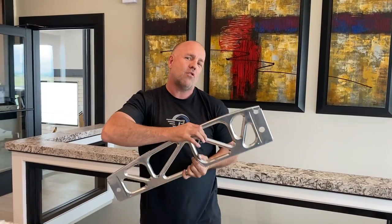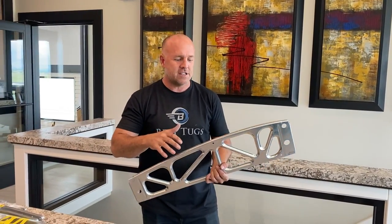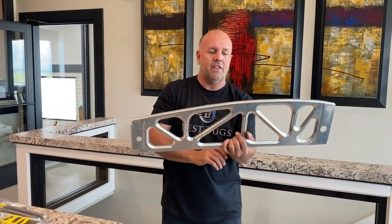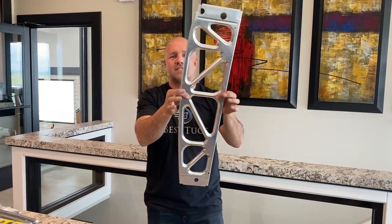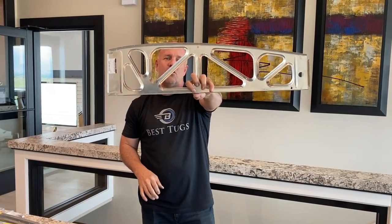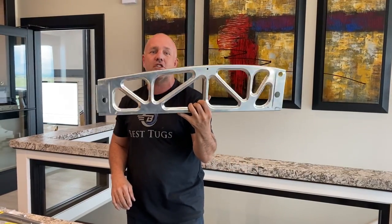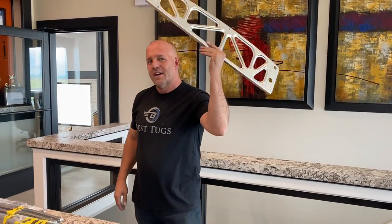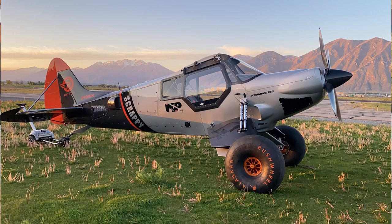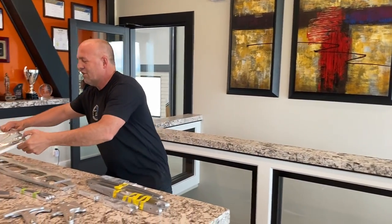If you have a fabric wing and someone gets up there and they run their hand across and they're trying to prop for fuel or do something on the plane or service, and they put their hand on this truss web, it distributes that 200 pounds on this little thin internal rib so much better that it's just a little safer for that, but it also is structurally a stronger web. So they've elected to go to a truss web. Now on Scrappy, I have to go to a truss web. I am wanting to do something a little more.